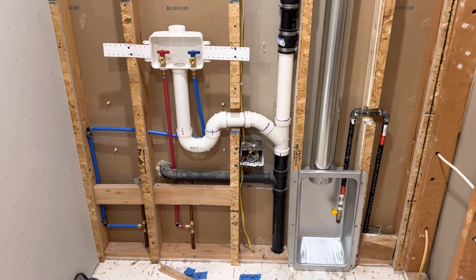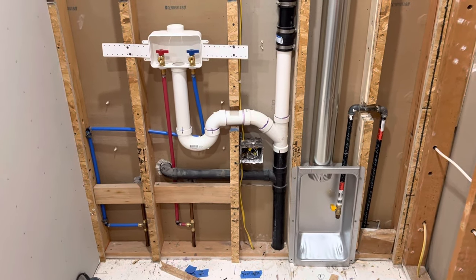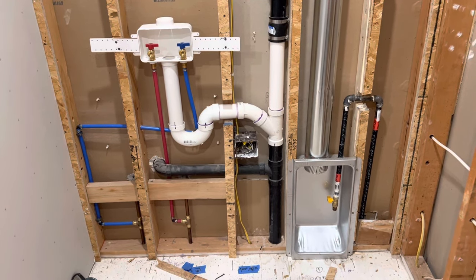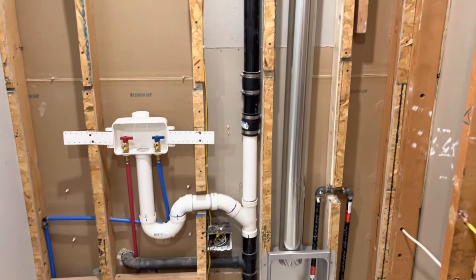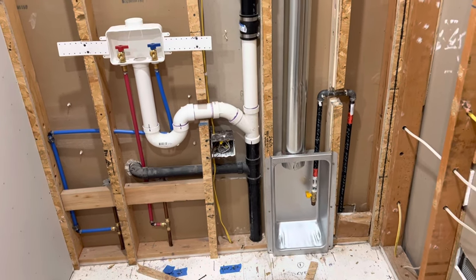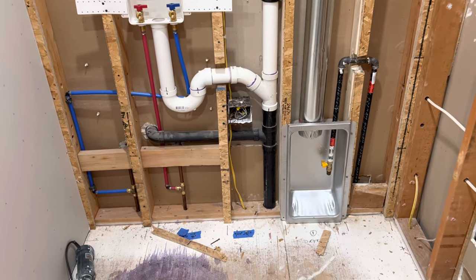This is my new laundry room plumbing. It involved a washing machine outlet box and a dryer box. The dryer box is an upflow design for six-inch walls. I had to fur the walls out a little bit with furring strips to achieve that, so I could maintain a four-inch round duct all the way up through the stud space.